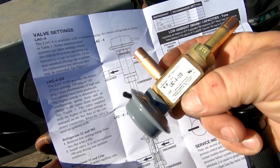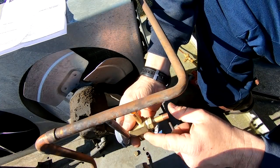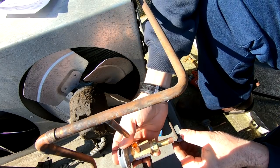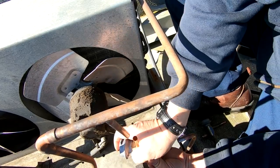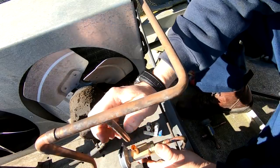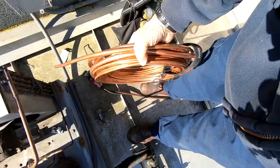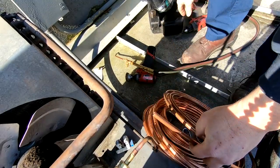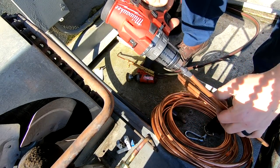LAC4215 - made in the United States. I love it when things are made here. So the receiver points down, discharge is right there, and we can fit that right on there. This piece right here we'll just make a stub real quick. I keep all my copper on one of those little Husky strap things - got half inch, quarter inch, and three eighths. To make it simple I just brought the whole roll up. Three eighths, this little drill can run it.